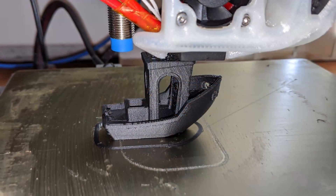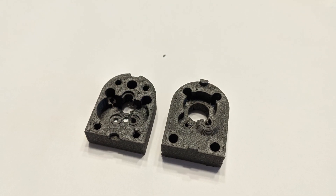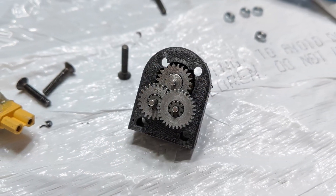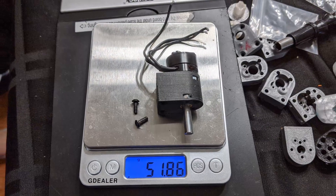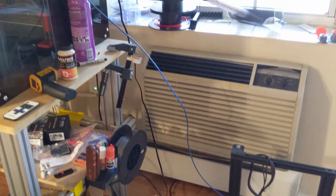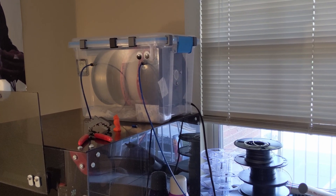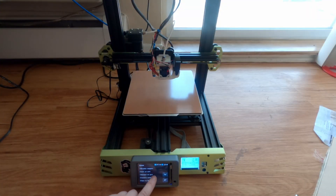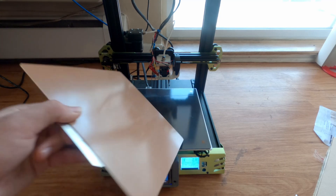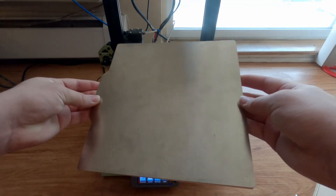While I still need to do some tuning and perfect the touchscreen interface, so far my results have been very promising. I've already managed to print out several carbon fiber nylon gearbox housings, which was basically what finally drove me to pursue this project. I've set up my dry box with a long Bowden tube leading to this printer, and I'll probably end up expanding my printer stand. I initially set up the printer with just the E3D V6, probe, and flex plate, but added the rest of the upgrades over the following week. I printed successfully on just the PEI-coated steel sheet, but it wasn't super reliable, so I finally stuck the Garolite on with some thermal tape — and that's worked great so far.